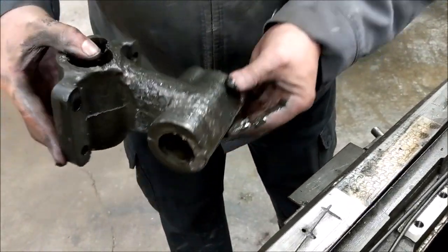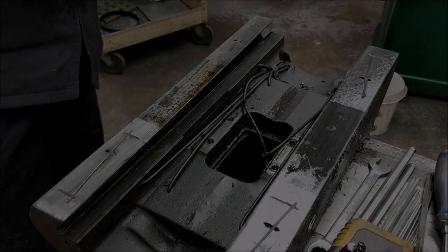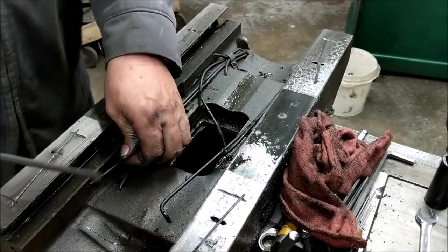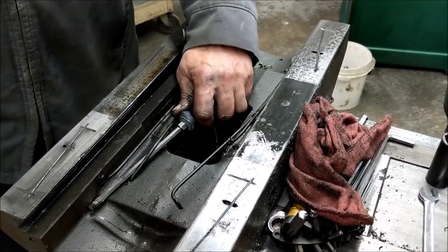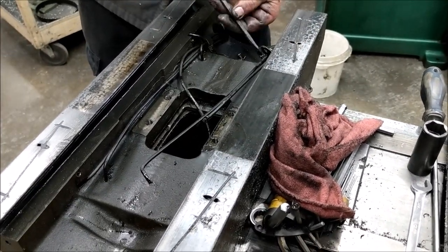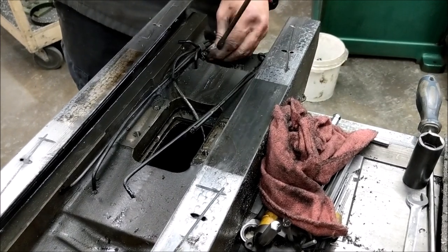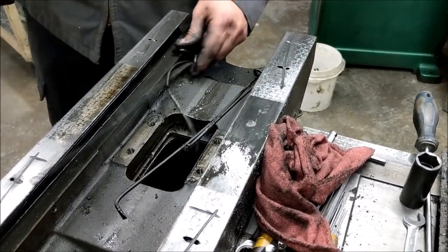Loosen it, lift, turn it 90 degrees, and you can see the lube line is still hooked up — give it a little tug and it comes right out. Make sure the key ways are still in there because if those are out you'll have to replace them. At this point release all the rest of the lube lines. The reason is when you take this off you can flip it over and take all of it off. If you're sending these to us, I don't want the lube system on here — it's just extra work for me and extra money for you.